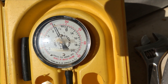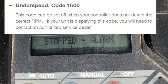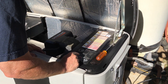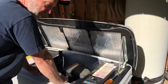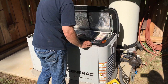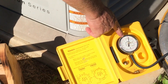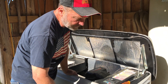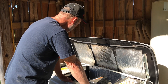So let's go turn the water heater on. Error code 1600 — there's no electricity in the house. I don't know why it happened but it latched a 1600 code and it's saying under-speed. So I'm gonna have to go back to the office and pull up the data on this generator and our water heater. One thing I do know is that gauge — while it did come down, it came down to maybe 17 or 16 inches of water column. It didn't fluctuate. That's plenty — I think that's more than what the manufacturer recommends. So I'm gonna go to the office and do a little calculation.